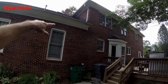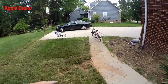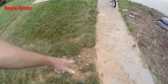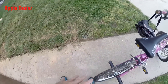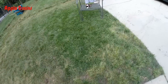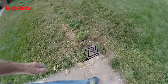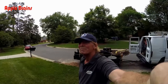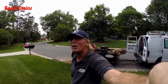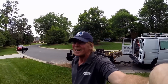The downspout is secured with a nice connection — just need to cover the area up. We also secured another downspout from the second story: it comes down to this gutter, comes across, and here's where we made our install. We tied into the line right here, came under the sidewalk, put a little tiny drain over here to help catch the water that's pooling along the walk, and also a catch basin over here — a much larger size — to pick up the water coming off the drive. Hey, this is Chuck with Apple Drains reminding you that if you believe you can do something, I guarantee you can do it. Have a great day!